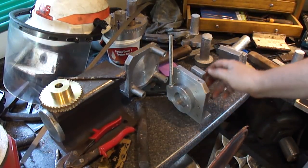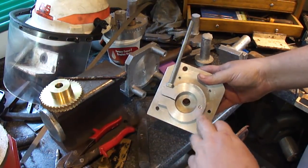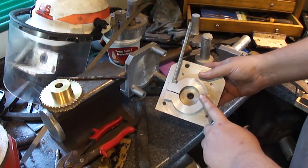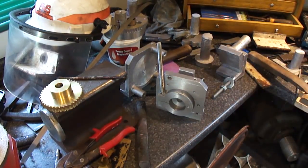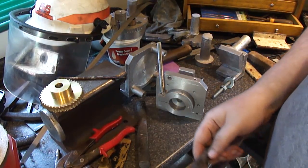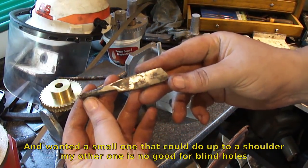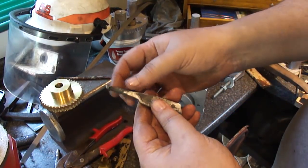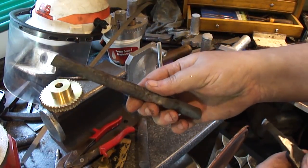Hello. I'm just messing around with this stuff. I did get the spindle brake and everything put on. I was just bored the other day and wanted to get something done. I didn't really want to grab the camera, so I did that up and got a board out. I needed a boring bar that could do real short stuff, so I went out in the forge a while back and just made up a little boring bar. It's out of 5160 — just a piece of coil spring out of a truck. Same stuff I've been making punches and chisels out of.